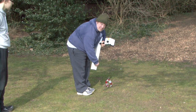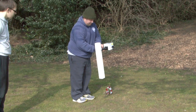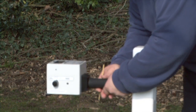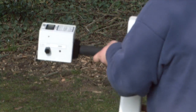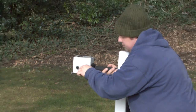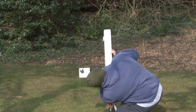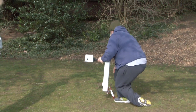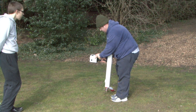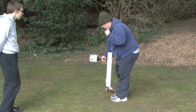The last direction we have to calibrate in is the vertical. This is a little bit more tricky — we have to use the stylus and this little hole here. It starts at plus 25, and we adjust it down through minus 20, minus 15, minus 16. That should now be calibrated — we press zero and it beeps four times. It should beep once if it's calibrated.